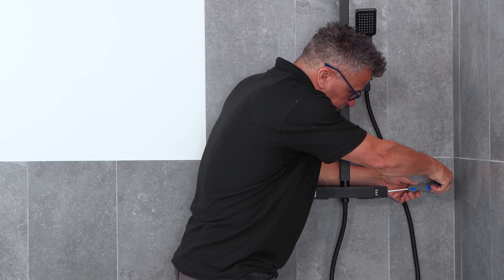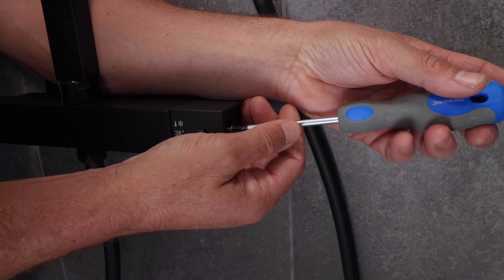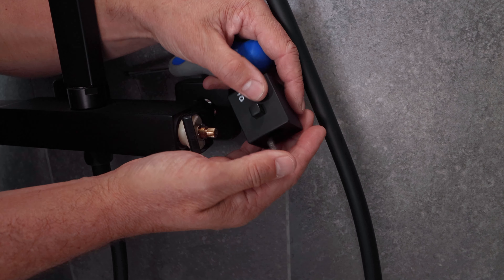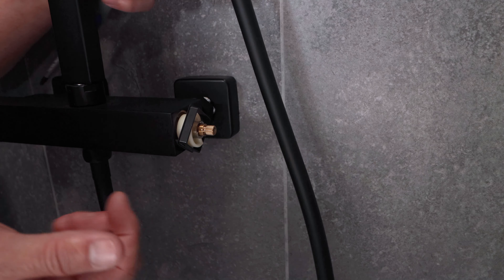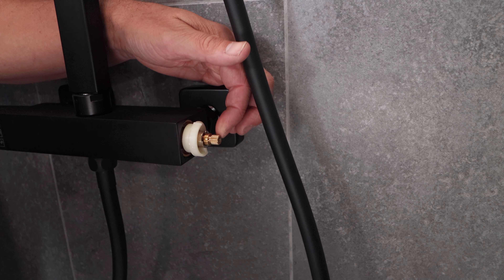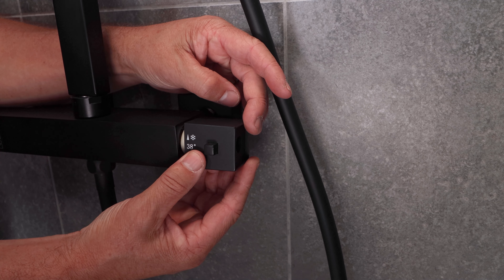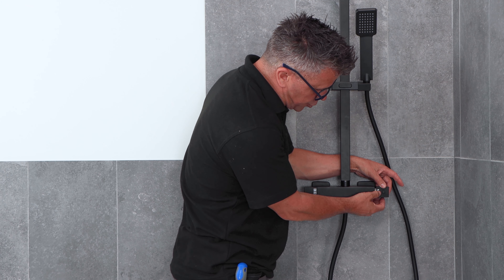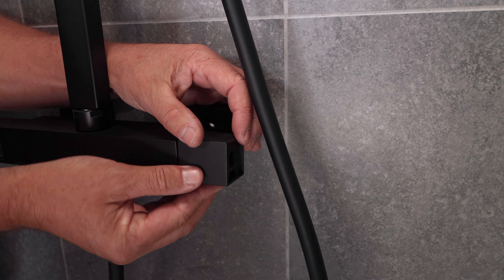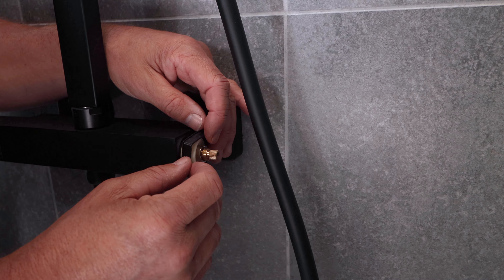You can take your Phillips screwdriver and unscrew one of the screws in there — it's not very long, usually only about 15–20 millimeters in length. That little section will come out and it exposes the thermostatic spindle. What we need to do now is turn that by placing the cover back on top of it and we can adjust it further down to make it hotter.